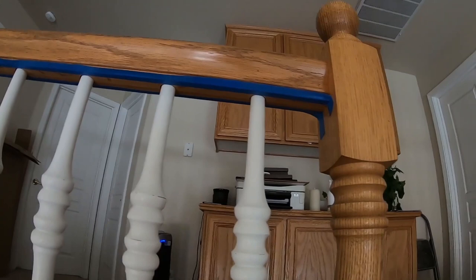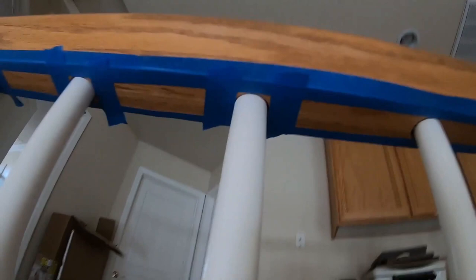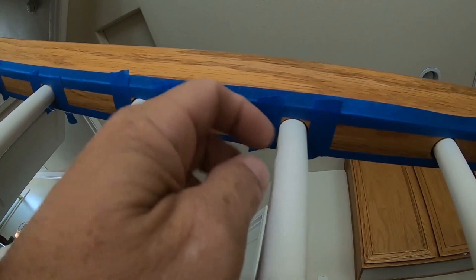That way you're not just sitting there picking at the tape. We don't have to wrap off the bottom, but we do have to wrap off all the walls and all of the carpet — so it's a long day of wrapping. After you do that, go ahead and put a piece on either side, and that'll cover up the majority of it. Make sure that you don't have the tape touching the spindle because that could cause bridging when you're spraying it, and if you peel it off it could potentially peel the paint off the spindle.